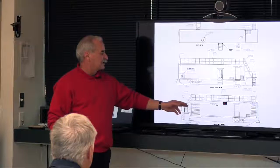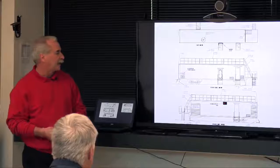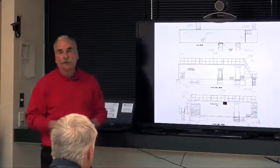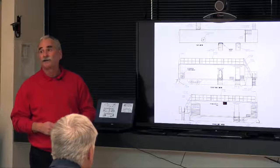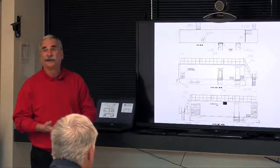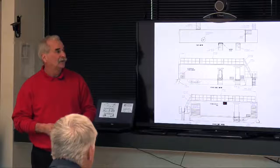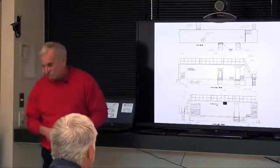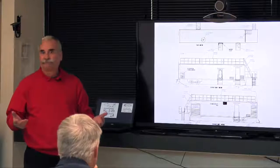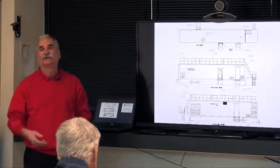On the front end of this unit, another addition that was added was a standpipe, so you can hook in your attack lines up on the roof. Behind that, we have the propane compartment with two 420-pound cylinders. Each cylinder will give you a usable amount of about 80–85 gallons of fuel. With a total of about 170 gallons, you'll get two to three days of training out of it, depending on how many evolutions you run.